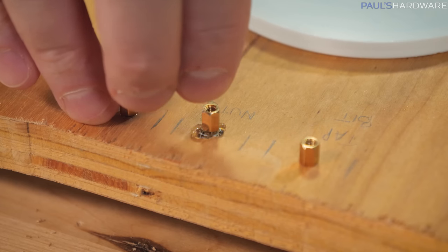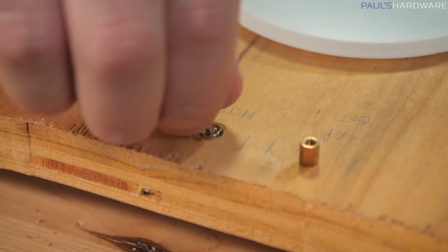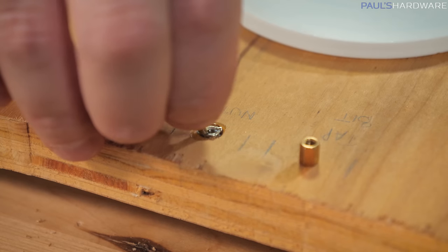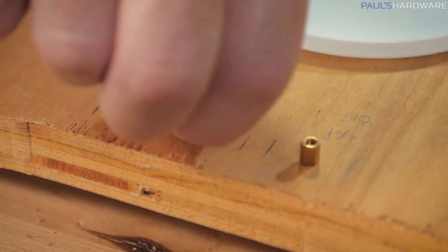The method with the nuts works, but I definitely hit a dilemma where to get the nuts in there and set in place, I had to use the standoff screwed in to hold it. And then I wanted to unscrew the standoff, but I was really concerned that the epoxy was going to keep me from being able to screw the standoff back in.